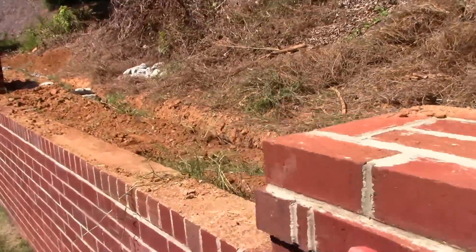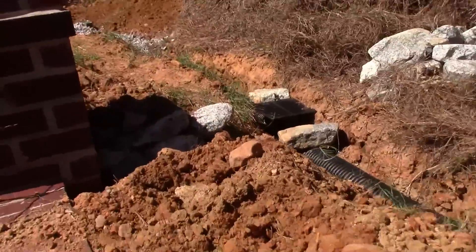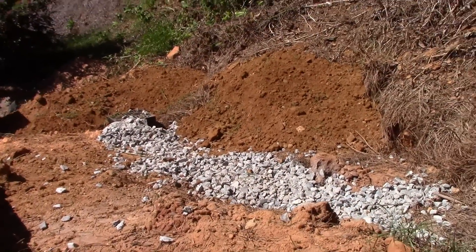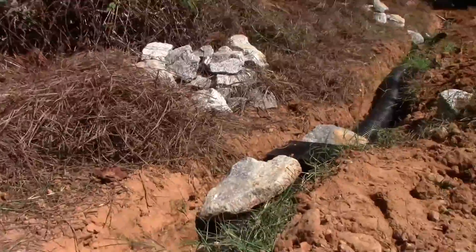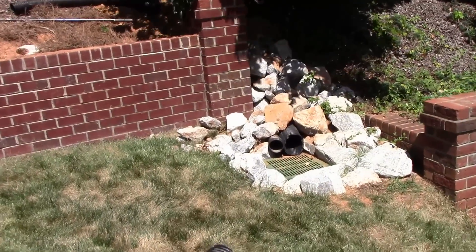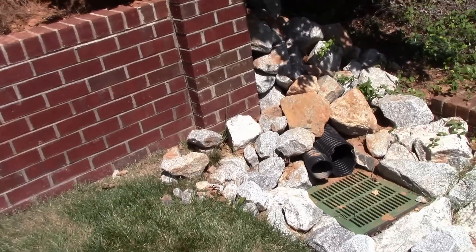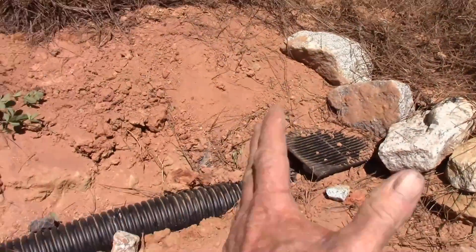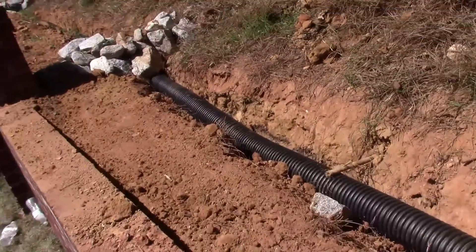Really not a hard job — it's just hot out here. We're just about ready to lay gravel. Looks like we might have enough soil up here to finish grading it out, and then it's just gravel all the way down our trench and we're done. We've got our riprap put back; you can see our six-inch coming out alongside that four-inch that comes all the way up. We're using the riprap as a stop because that water comes down this hill.